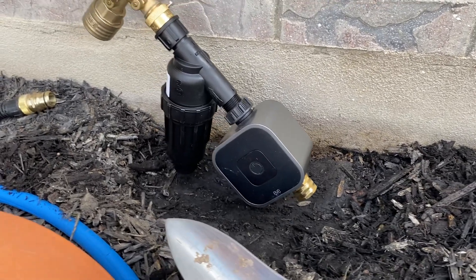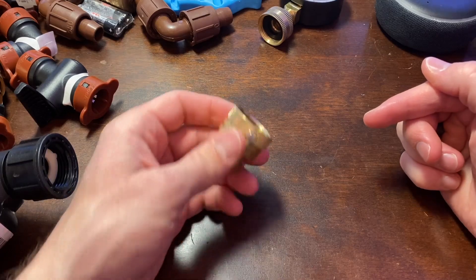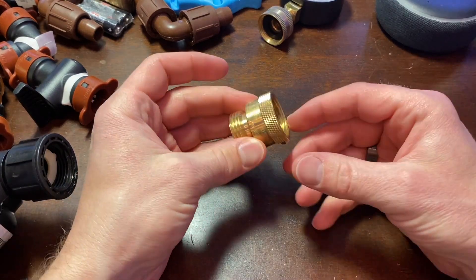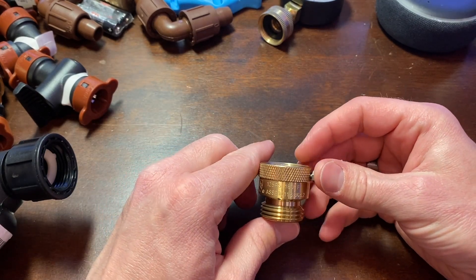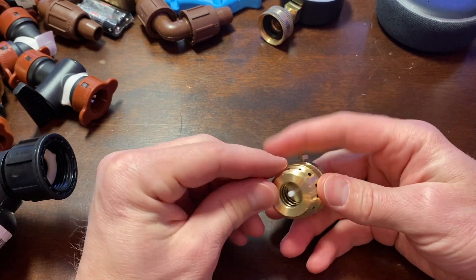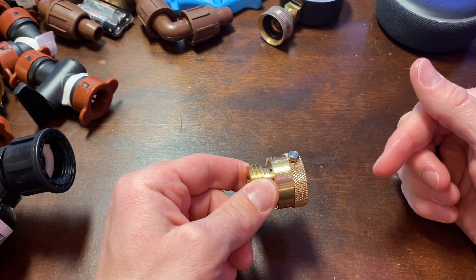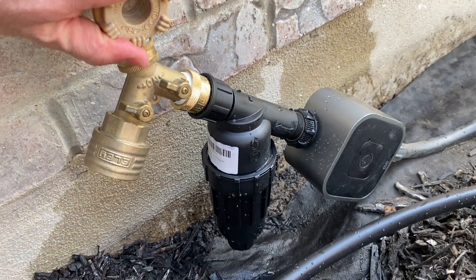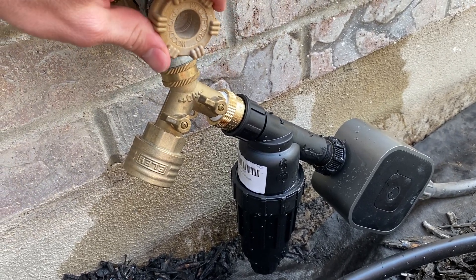Here is my head assembly. These don't necessarily have to be in the exact same order, but this order seemed to make sense for me. First thing off the Y-valve is this backflow valve. The reason I have this is that once the water comes through into my drip system, I don't want any extra pressure to allow it back into the pipes in my house. Different fittings have different pressure ratings — PSI, pounds per square inch. Check it to see that you're getting at least roughly 60 PSI. This one went up to like 120 PSI, so it was plenty. Coming out of my house was kind of the max, about 60 to 70 PSI.